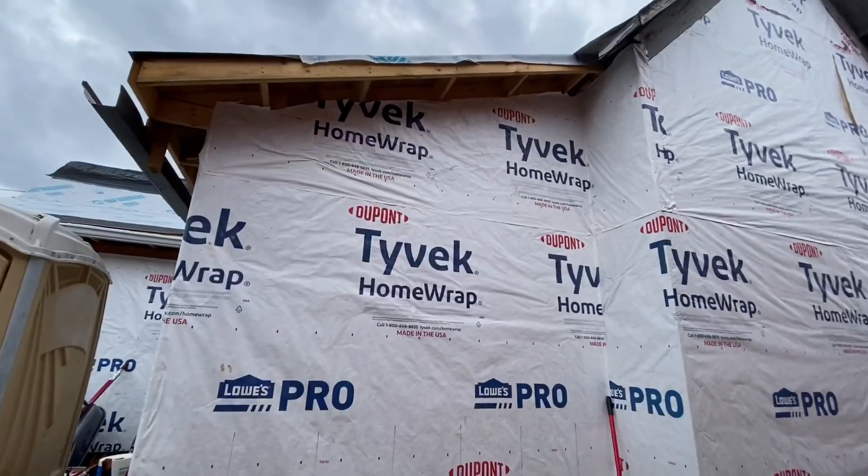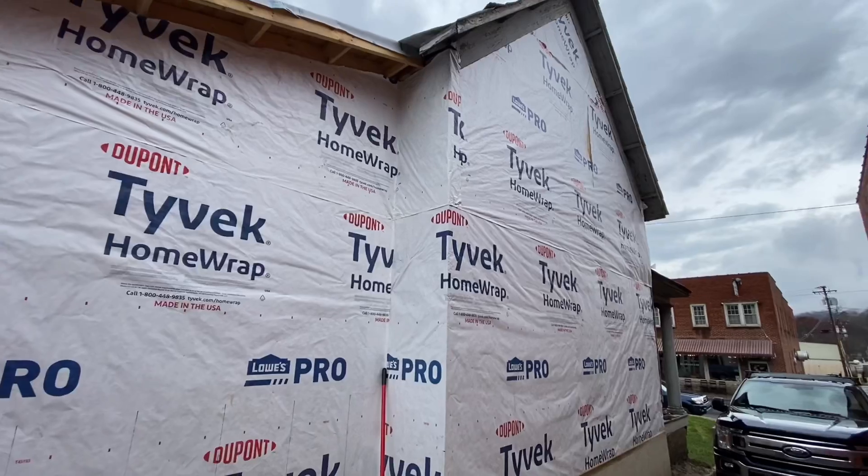As much as I hate to see the old siding go, we are going to tear it all off and replace it with half inch OSB followed by builder's wrap, new windows, and spray foam insulation — making it completely modernized with a new building envelope. Many people have said just bulldoze that thing and build a new house here. Well that would have been fun, but I don't want to do that because there's something about the character of an old house that you just cannot replace.